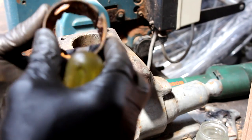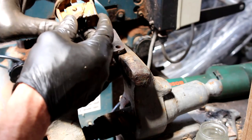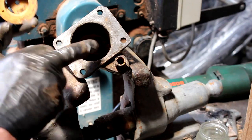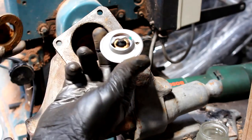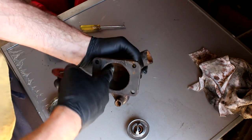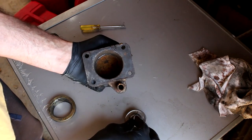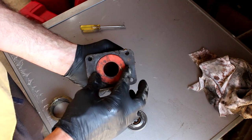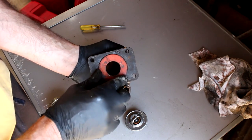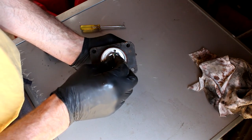Okay, got that sleeve out — what a mission. You can see how I had to collapse that internal part just to give it enough wiggle room to come out. So that's the old one. Now what I've got to do is clean all that out, give it a good scrub, and make an adapter so I can fit a cheap thermostat in there. There's a little bit of a seat in there but the new one is too small for it — it just slides past the seat. So I found this washer which is just a little bit bigger than the thermostat housing. I'll put that in the lathe and skim it down so it's a nice tight fit in the housing. The edge of that will sit on the seat and the thermostat will sit inside there, stopping it going all the way in.